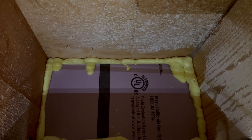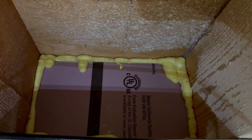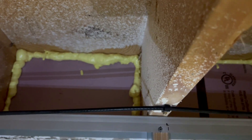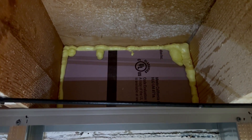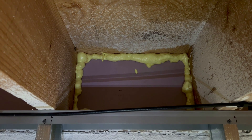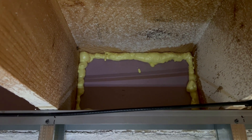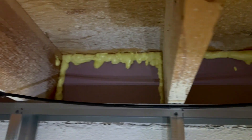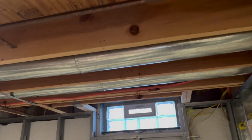You can see some I did better than others — these are areas where I thought I missed the mark and sprayed more. The point is: don't over-spray it, because it does expand for about 30 minutes or so after you spray it. So what else did I want to show? Let's get back to the temperature readings.